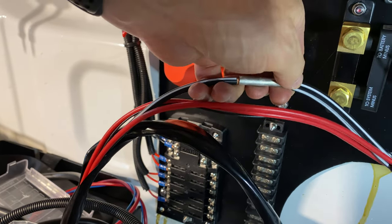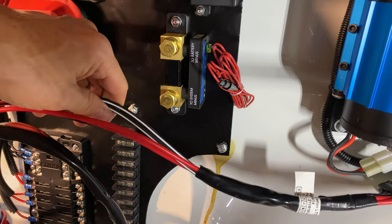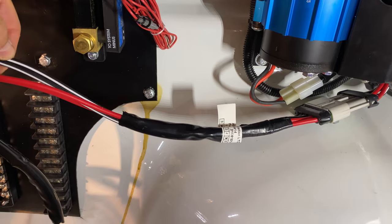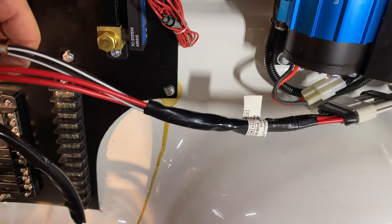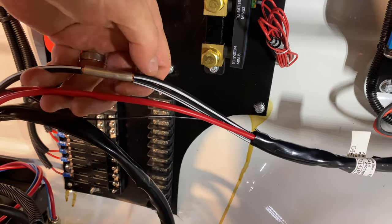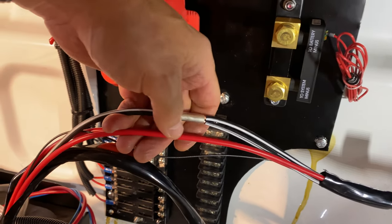For my purpose, I'm going to cut back onto the twin and connect straight to there, so it's nice and short, because I'm only running a short distance from the plug to the shunt. Whatever you do when you do parallel cabling like this, always cut at the same length. Cut the grounds both the same length, cut the positives the same length. It's important.